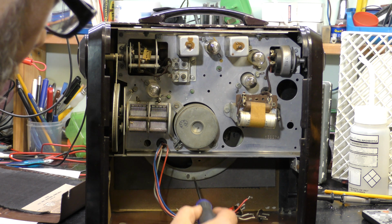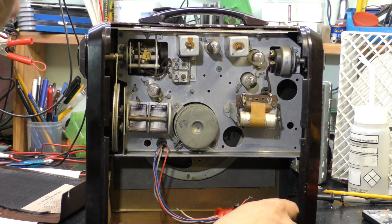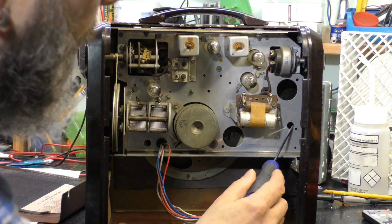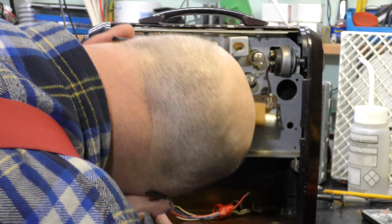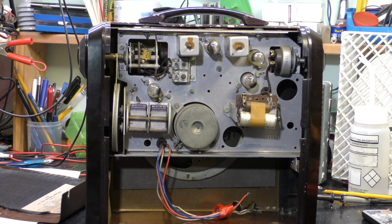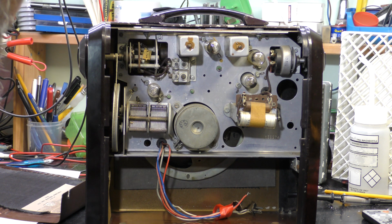Now apparently to get the front off, so you can work on the radio, there are a couple of nuts and bolts here. Also there's self-tappers, and it's in this hole here I believe, and I think I can see one. I'll put my head right in the way now. Down this little hole here, so there's a self-tapper there. So we'll get the front off, and then also going to have to remove the speaker to see what components we've got. No doubt loads of waxies.